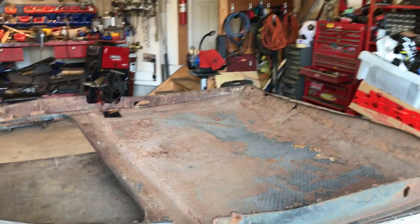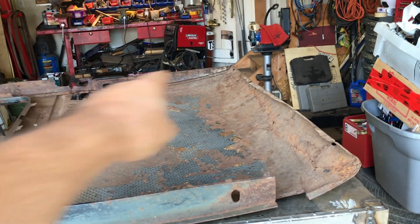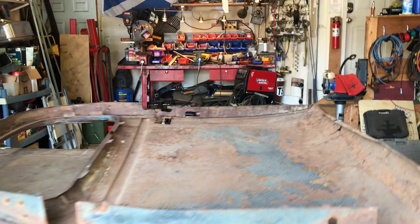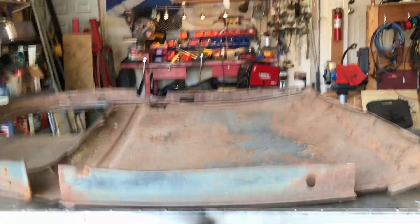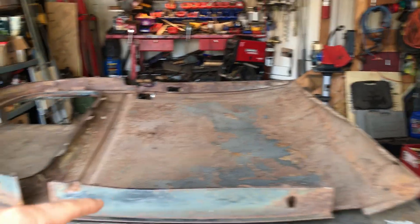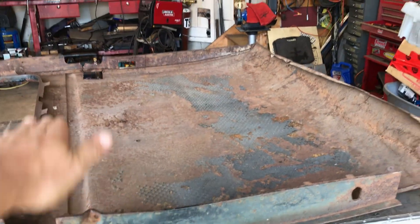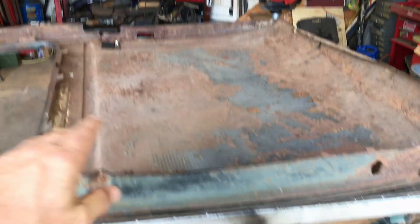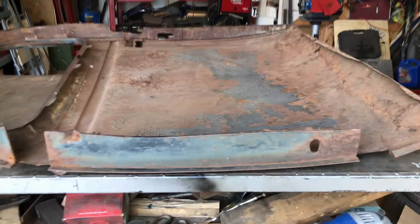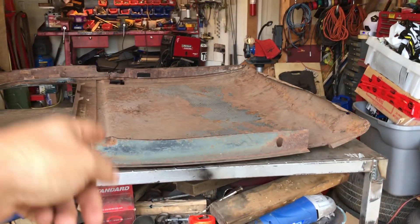Right, very slight alteration to the plan. I realised that priority is to get this square frame as flat as possible, which is going to be pretty hard if I cut this plate first because it's all banana shaped. So what I'll do is make the frame first to fit the outside dimension, because the height of the frame doesn't actually matter at this point as long as the frame is flat. Then I can cut this plate to shape — I'll probably use the cardboard to make a template because it's kind of awkward and it curves round that way as well. So square plate first.